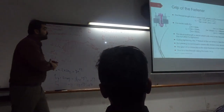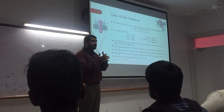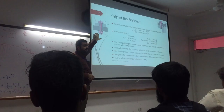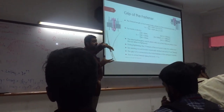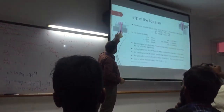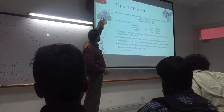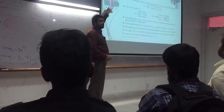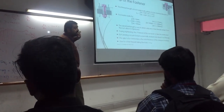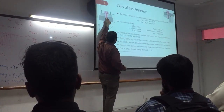Another important concept is the grip of the fastener — how much material is the fastener gripping? If you have a bolt or a stud like this, how much material is being gripped by the actual assembly? It is everything between this stud and that bolt head. That includes this fastener and that fastener, this position and this position.